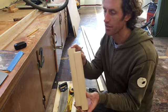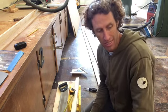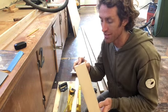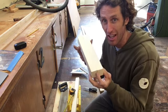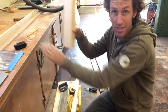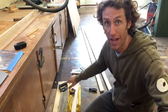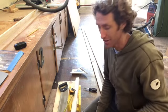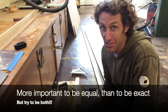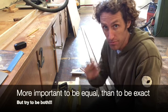You saw me get my eleven and a quarters. Make sure they're exactly the same — it's very important, otherwise your step will be a little wonky. If they're not, I'll teach you a trick to use sandpaper on a flat surface to just sand them down a hair. Now moving on to the five and a quarter — they have to be just as precise. As long as they're both the same, say five and three-sixteenths, that'll work out just fine.